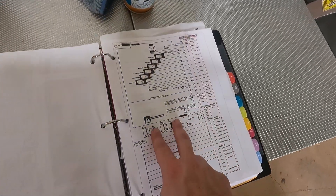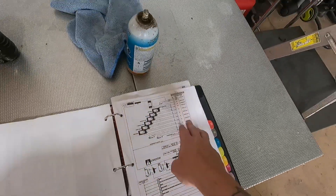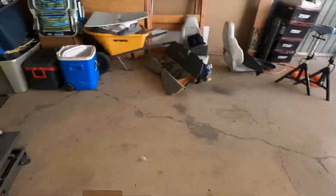Through some troubleshooting, I figured out that the diodes had burned out — or one of them burned out — on the gear solenoid, and ended up frying the gear controller. That brings me to my point.